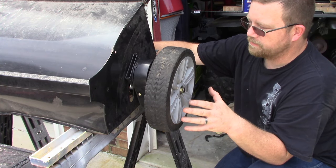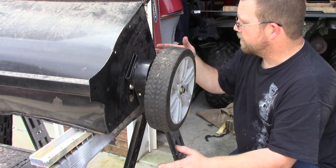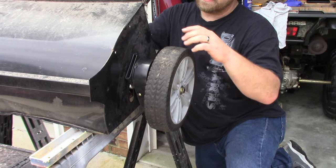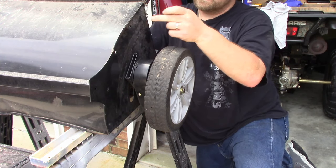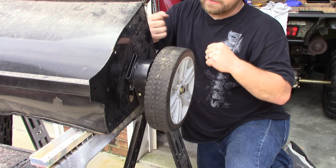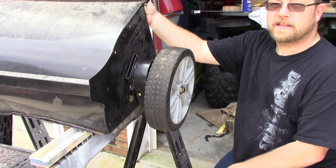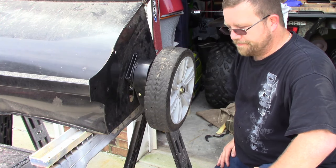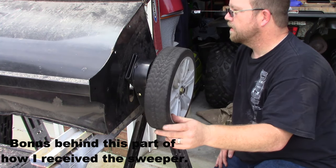Things to remember: when you've got this, put it up on a platform like this — don't try to do it on the ground, it is a pain. If you can put it up where it can be supported, that's perfect, because when you go through the bolt here this carriage assembly will rotate. It's a pain trying to get that bolt to come into the actual base. On the other side where the handle is, you've got to jostle and work it around a little bit, but you can get it done — it's just tedious on that side because you've got the leverage controller there for the height. This is Trav — if you've got any questions, just let me know.